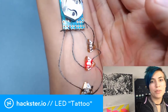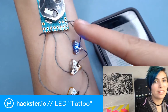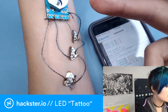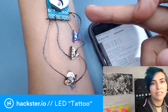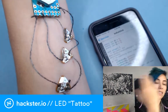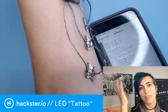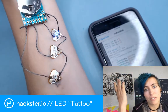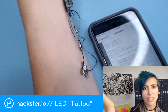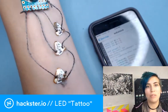So that is version number three of the LED tattoo. I want to update the way they're connected because right now the conductive thread — that's stainless steel thread you can get on Adafruit, SparkFun, and other places, linked from the tutorial — has a tendency to fray and is kind of floppy, which means it can accidentally contact itself. I've done a pretty good job of avoiding that in this round, but it is a challenge. However, the positive thing about the conductive thread is that it's really easy to reposition, so you can sew your circuit together, then decide when putting it on your skin how you want it arranged. Plus it's quite durable, so you can reuse it multiple times, and it doesn't bother it much if you flex it — it can handle an absurdly large number of flexes.